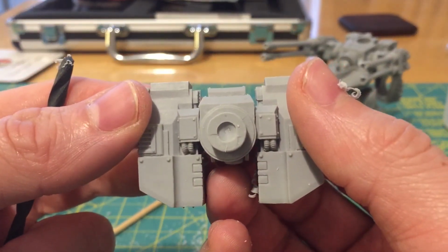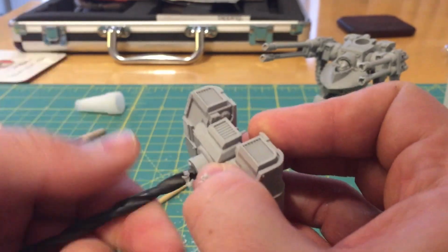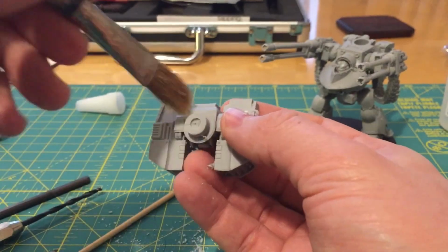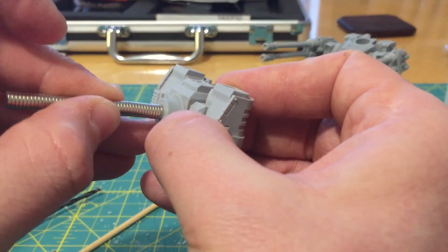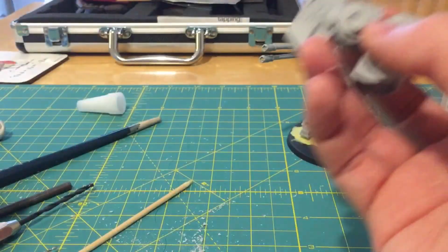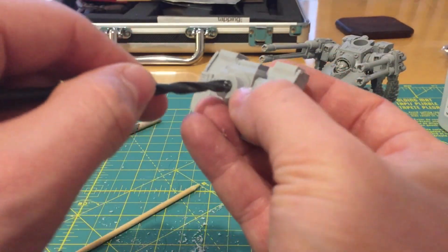So there you go, that's nice and central. That's the other thing that you want. You want to make sure you get your magnet alignment central, particularly when you've got rotating parts, because otherwise it'll be a pain. So I just need to expand that a little. Oops. With the correct drill.